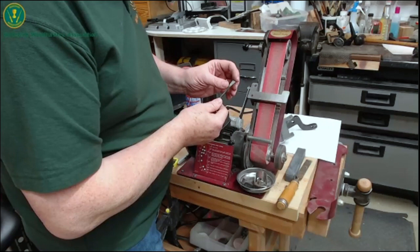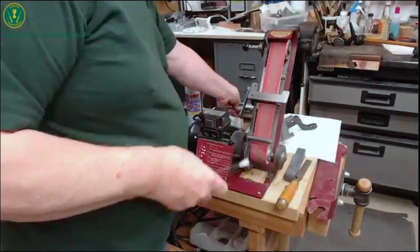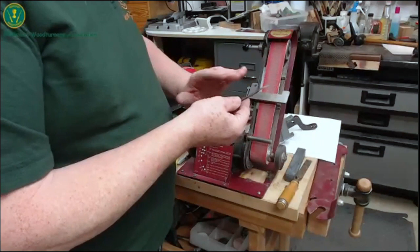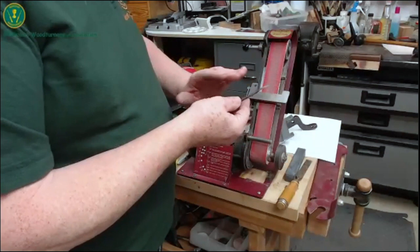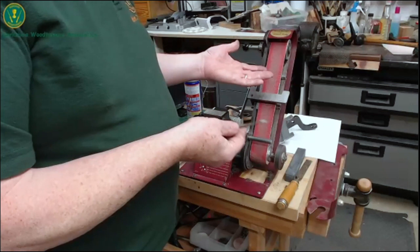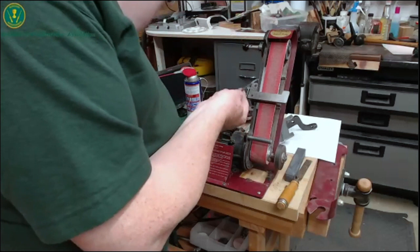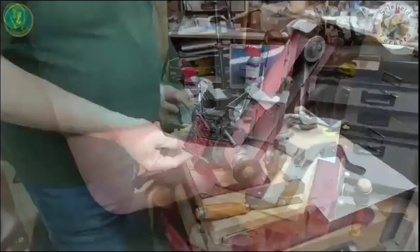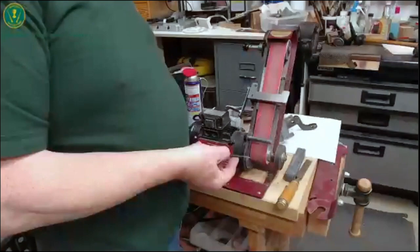The wheel at the bottom is designed for honing. I don't find it very successful. You hone away from you; you sharpen towards you. That's why the Pro-Edge goes away from you, because it's a sharpening and honing system as opposed to other ones which are more grindy. The benefit of the reverse on the Axminster Ultimate Edge is that you might sharpen towards you on a coarser belt, then flip and hone the other way with a 600 or 800 Trizact.